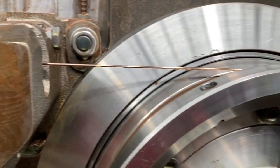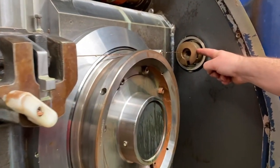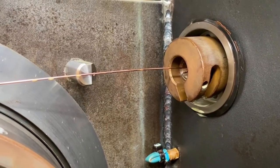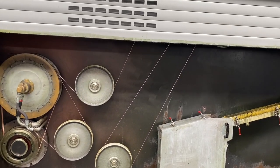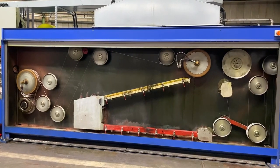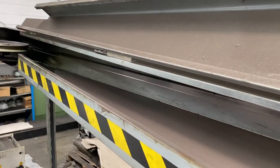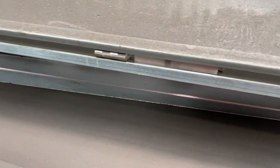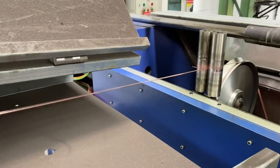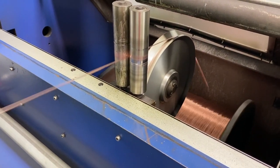This larger wire drawer will draw down to one millimetre in diameter; anything else gets put through the second wire drawer on site. At the finishing die stage, the copper is what we call work hardened - it has become quite brittle. The second part of the machine softens it up, passing through annealers and high-pressure steam tubes to clean it. The operator inches it through before running at full speed - at the take-up drum we're running at about 30 metres per second, with each drum carrying about two tonnes.